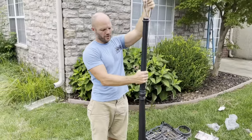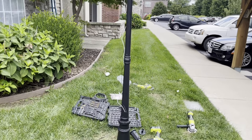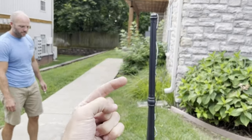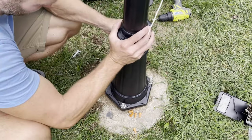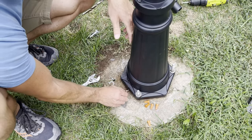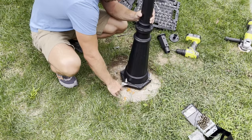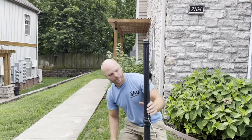It's nice to hold on to the wires at the top so you're not just twisting the wire up in there. We have the top piece on now, but I can tell it's leaning. If you find something of substance like the edge of a building to reference, you can see this is leaning one way. So we need to shim that corner — loosen up the nut, have somebody help you push it back where you need it, put something underneath the edge, then crank it back down and look at it again. It's a lot better now — still maybe a tiny smidge but not nearly as bad.